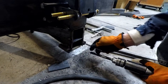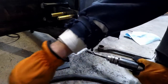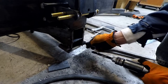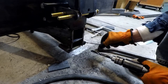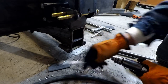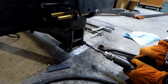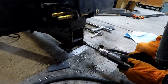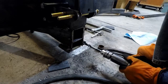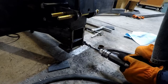So while we're waiting for the air compressor to catch back up — what are the two most common causes of drill failure? First is over-speeding, going too fast. We're not doing that with this drill. The other one is under-feeding, meaning not pushing down enough, not giving enough pressure. That's probably something we are doing, but that's as much as this particular drill will allow.